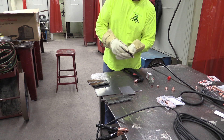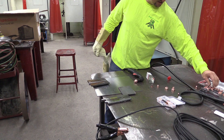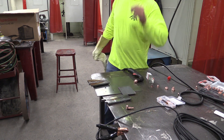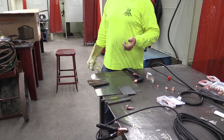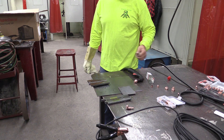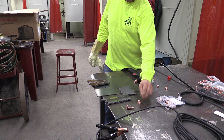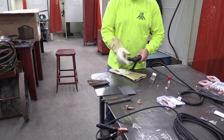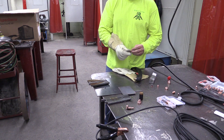When you talk about expense with these consumables - the electrodes and nozzle setups - each of these is about $5 to $6 a piece, so you're about $10 to $12 just for those two pieces. They are consumable, so eventually over time they're going to wear. When they wear out you have to replace them - it will affect the arc, give it a wider arc, and not as fine a point. The caps are somewhere around $20, the retaining rings are a little bit more, and the swirl rings too. They're not cheap, but if you take care of them they last a good long time.